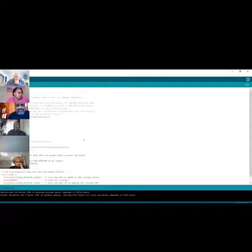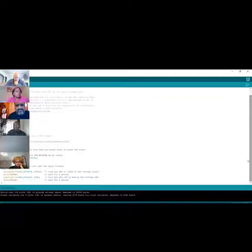Yeah, gotcha. Now, the LED on your microcontroller and on your breadboard should be blinking. Now, if you go in and change that 1000 to delay 5000 like we did a minute ago, you should see it blink for 5 seconds on, 1 second off.